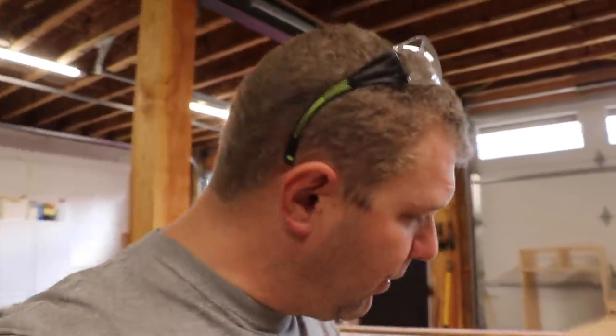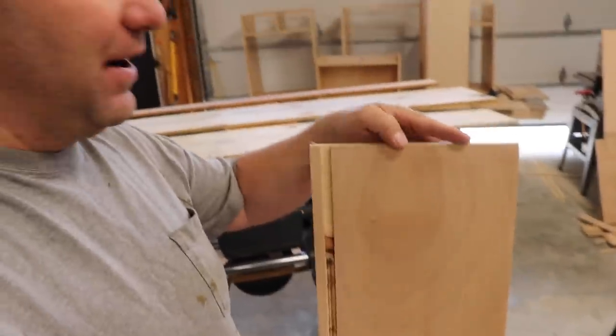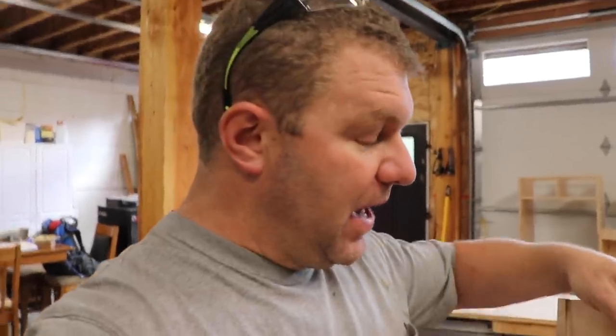Of course, there is some grain to this wood, and to get rid of the grain, one of two things is gonna happen. We're either gonna have to sand off the veneer practically or get really deep into that veneer, which comes with risk, or lacquer it really heavily, which makes no sense to do. I think this is good enough. It's nice and smooth, it's smooth to the hand, and when we put a good coat of lacquer on there, it's gonna add a smoothness to it that's just gonna feel good, and it's gonna be super cleanable.